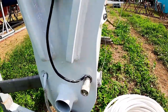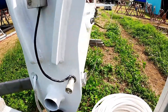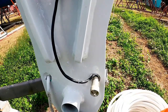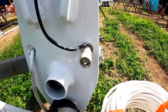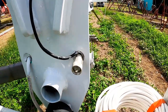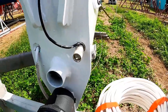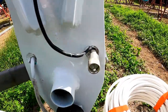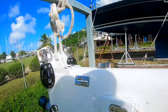They've run it down such an incredibly tight piece of the extrusion — I don't know how they got it in there in the first place. My new cable is ever so slightly bigger; it's the same style and model but it's not going to work. So I'm going to keep the cable itself, replace the lower fitting, clean up this fitting with contact cleaner, and make another little section from here to the antenna.